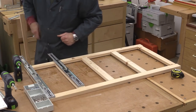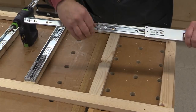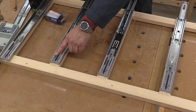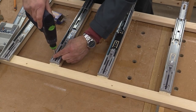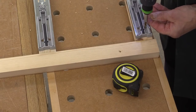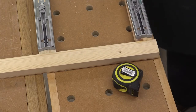I've set the torque reasonably low — I don't want to strip the wood. These Accuride runners are nicely packed when you receive them and very easy to get going. Just take out that piece there, get it in place. At the rear of the part that goes onto the frame there are a pair of holes, and I'm using some 3.5 by 16 screws straight in — you don't have to buy any special screws, these came from Screwfix. It's a good idea to try not to get any sawdust or detritus into the parts of the mechanism because these are the important bits which do the self-closing function.